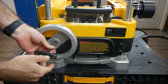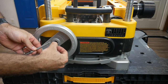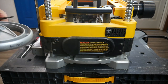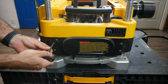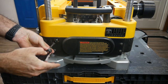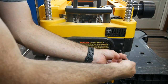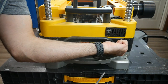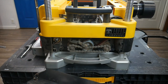Next part is to take the handle off. We're using the Torx that came with the machine to get the middle bolt — remove the bolt and then slide the handle right off. We have four screws on each side of this panel. We're going to remove those with the Torx that came with the machine, and now the panel will just slide right off.